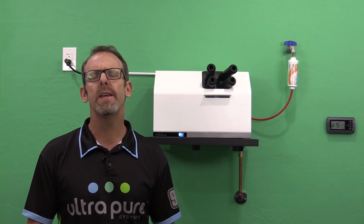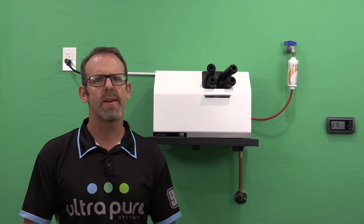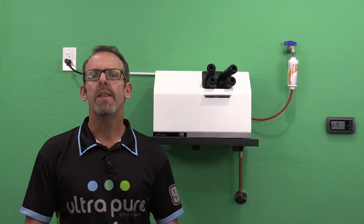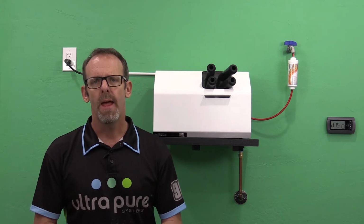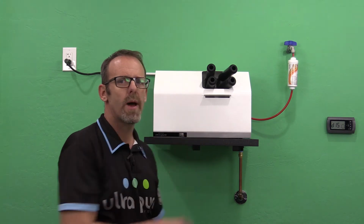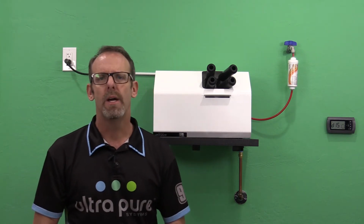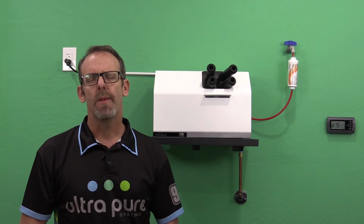But for some reason, if those were not put in, or if they were taken out and then something might have got through the pipe, it's hard to say. This is the #1 reason we have found the EL alarm will occur. And that is the fill valve on the side of the humidifier on the right-hand side behind the black panel gets stuck open. And it's really simple to change out.